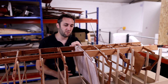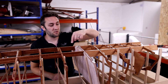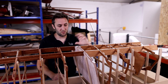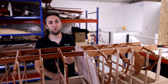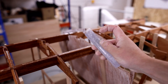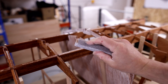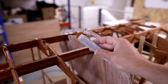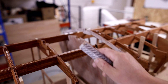For the frame faces I'll probably just scratch those up. We want to sand the areas around the stringers and key up anything in the vicinity of the joints we're gluing, which is mostly around these two stringer notches. For this you want a pretty coarse sandpaper — 150 grit maximum. I'm using 80 grit here. We want to really key up that epoxy heavily so it's got a good hold to bond to — epoxy bonds fine to itself providing it is heavily keyed.